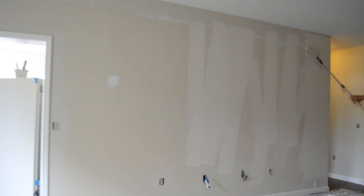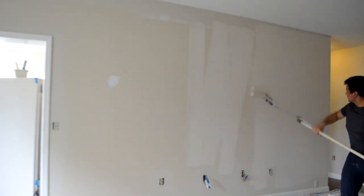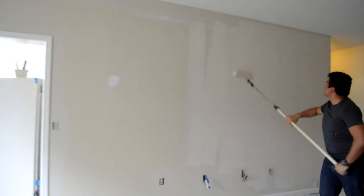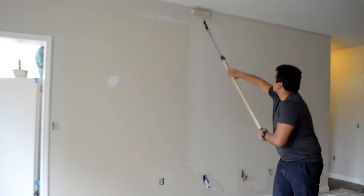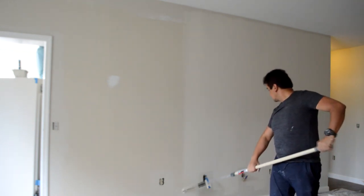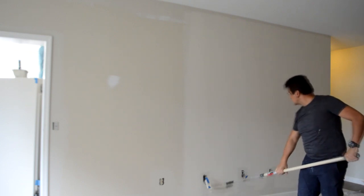I passed this roller about three times. The first pass spreads the paint that's already on the wall. I get close to the top, but I don't have to worry because I already went with the small roller, which helps thicken those cuts and avoids going back up the ladder. I'm painting a section about eight feet wide — you can see how fast I'm covering the surface. I painted around the outlets, media connections, and all the stuff before doing all those cuts.